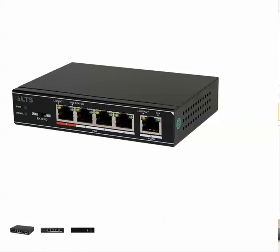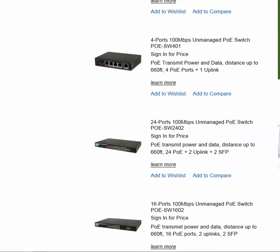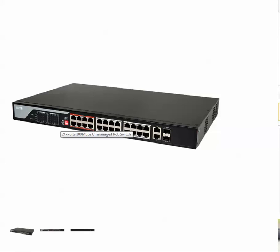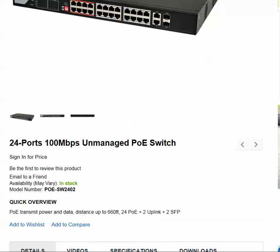These units all have a 3 year warranty and they're available in up to 24 ports. Going back to extend mode — this 200 meter PoE — that's basically a feature that would be turned on using dip switches. If you do turn on that feature, you should note that instead of getting a 100 megabit connection from each of these ports, it'll drop down to a 10 megabit per second connection, but you still have an uplink of gigabit using either the TCP/IP or the SFP fiber.